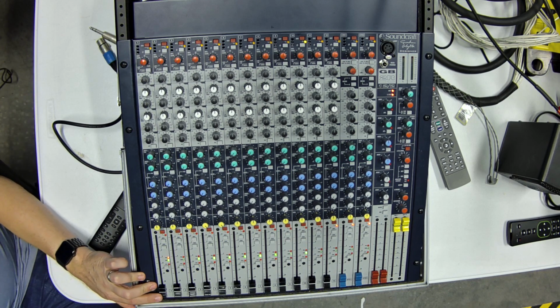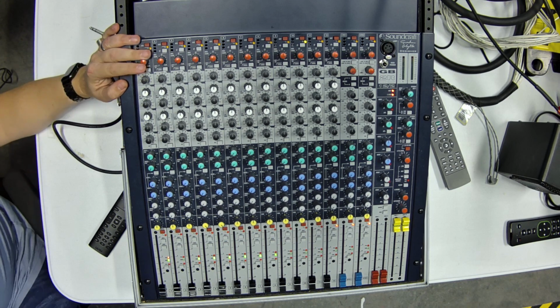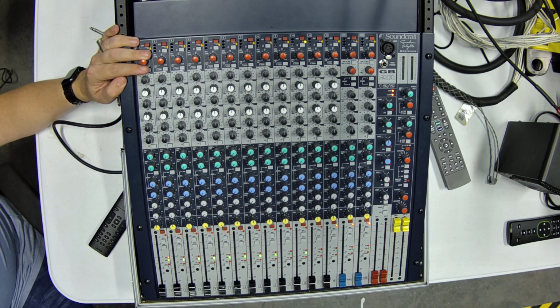Turns out, we'll get to this in a minute, the fader doesn't actually amplify. It's an attenuator. It makes things quieter. But the preamplifier's job is to make stuff louder. And good preamplifiers can amplify the signal without amplifying their own noise. The preamplifier absolutely introduces noise, and hopefully it's not very much. And you pay for that. You pay for preamplifiers that have low self noise and don't amplify that self noise.